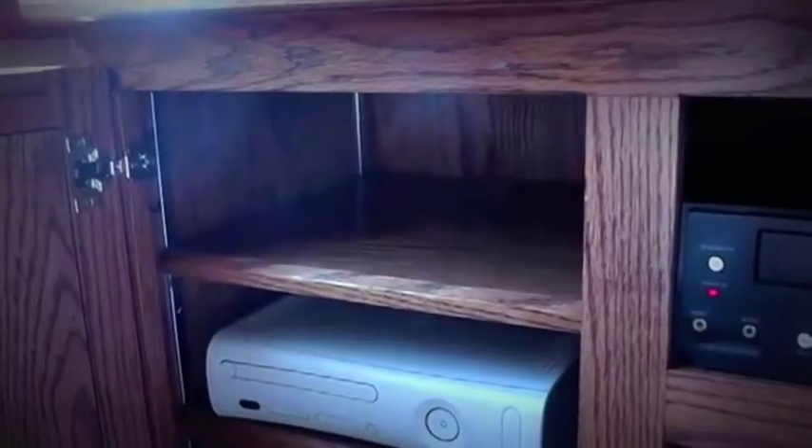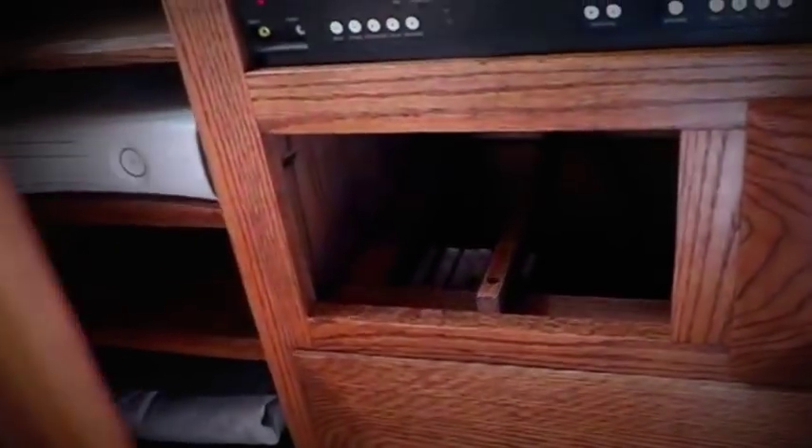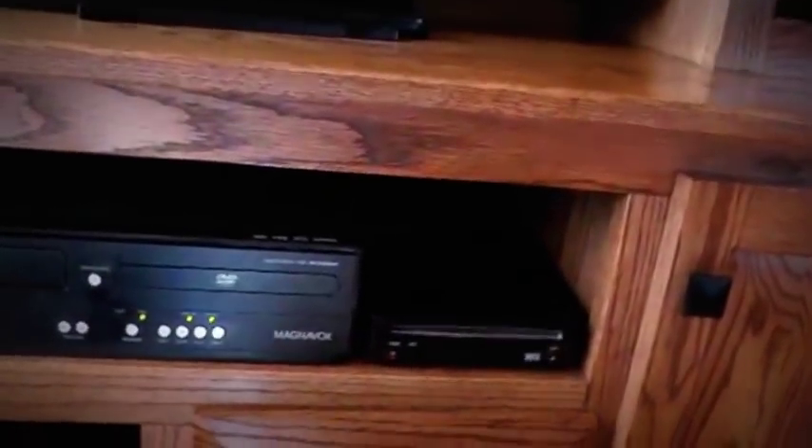There are three adjustable shelves per side and we could put more or less shelves for DVD storage. They've got their Xbox in this one. We got the soft close hinges for opening and shutting multiple times. On each side of the cabinet there is shelving for decorations. I kind of tried to make it a dual-purpose cabinet — I wanted it so that if they ever did want to put doors across the TV, I just put face frames around so we could easily remove this piece, which I just have pocket-holed in the back, and put a style across there and easily put doors to shut the cabinet.